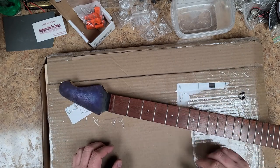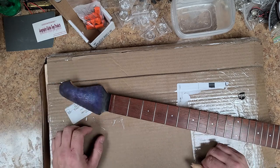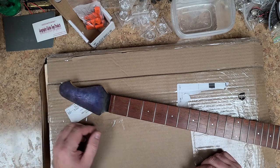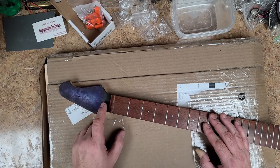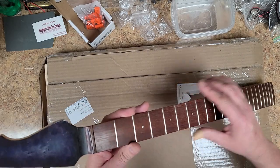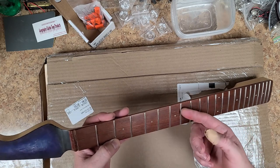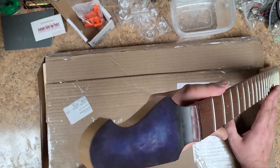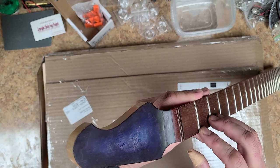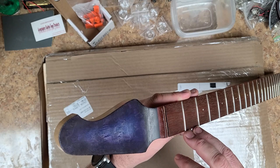Right here we have the Sterling neck, and I'm waiting for a decal that will be going on the neck. This part is almost done — I just have to put the clear on it, the epoxy resin, and I found a way to bring it up the slope so it will work out perfect. But one of the problems I've got right now is I did some cleaning of the fretboard, getting some of the goo between the fret and fretboard out of there, and I'm noticing that there's a lot of fret ends that are raised up. I tried to put a little CA glue and clamp it down — got some CA glue residue still, and it didn't stay.